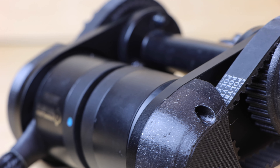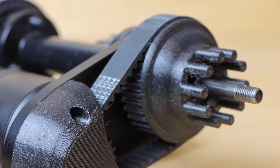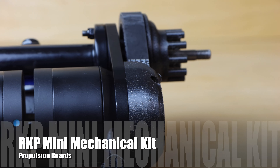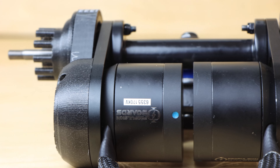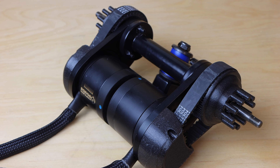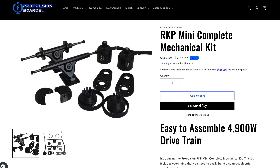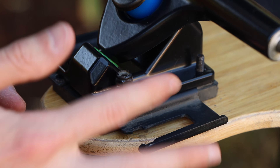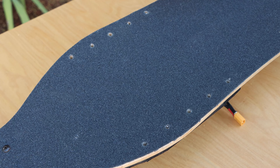For the mechanical components I used the RKP Mini complete mechanical kit from our online store, propulsionboards.com. This kit uses proprietary RKP Mini trucks and dual 6354 motors for a maximum power output of 4,900 watts. There's a detailed review and assembly tutorial linked in the corner. I first mounted the front truck to the deck using standard skate hardware with a riser pad and shred lights mounts, then mounted the rear truck with the drivetrain assembled, also using standard hardware, riser pads, and shred lights mounts.